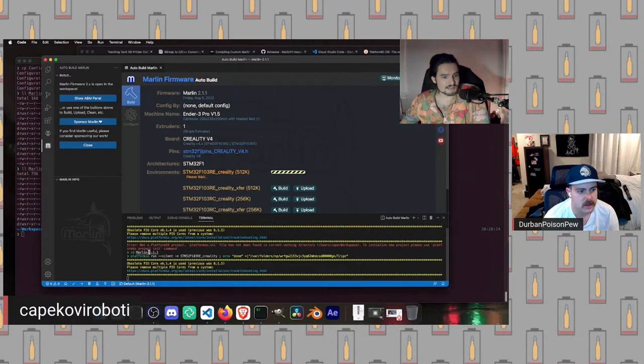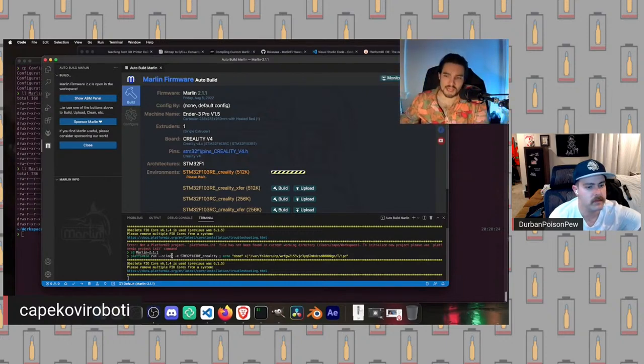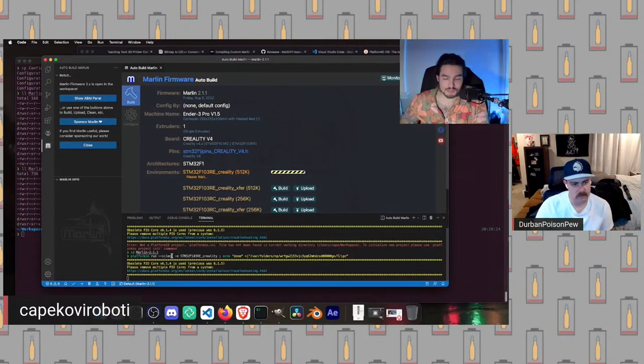Now you can see, because we're in the right directory, it is actually starting to build. If we edit out this silent command, we'll see a huge amount of info on everything it's compiling. The good news is it will cache the things that it compiles pretty intelligently. So the first time you run it, when you have nothing compiled yet, it will take significantly longer than the second time you compile it, when it has a lot of things cached.